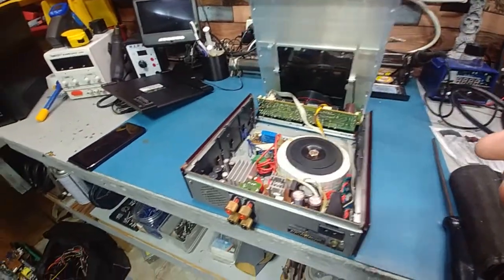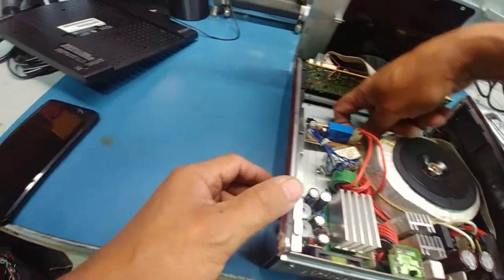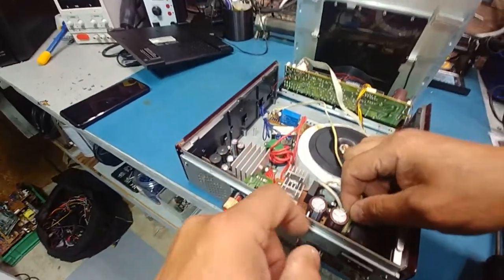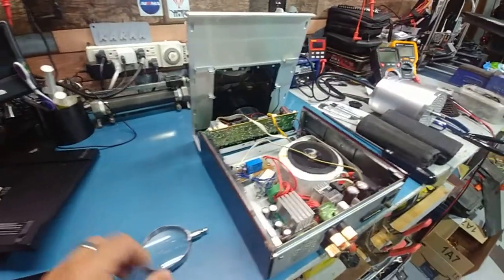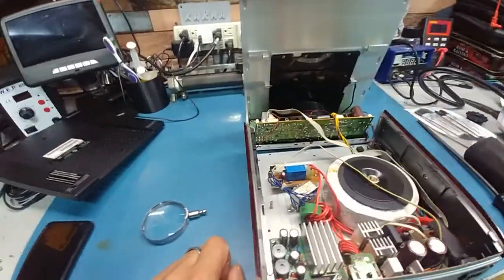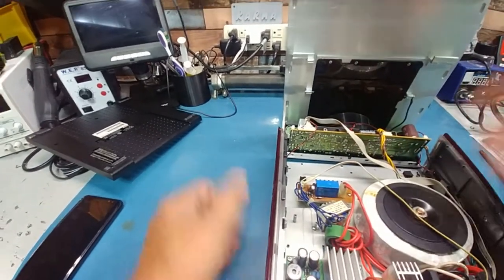Let's see what we've got here. Where does it go? It goes over here and plugs in right there. I don't know if it has any writing on it - let's take a look. Yeah, that's definitely our wire. One pin says VCC, the other says ECO, and the bottom one is ground. That would go through these pins right here to the other component that would plug into this to hit the turn-on relay, which would turn the transformer on and give us power.